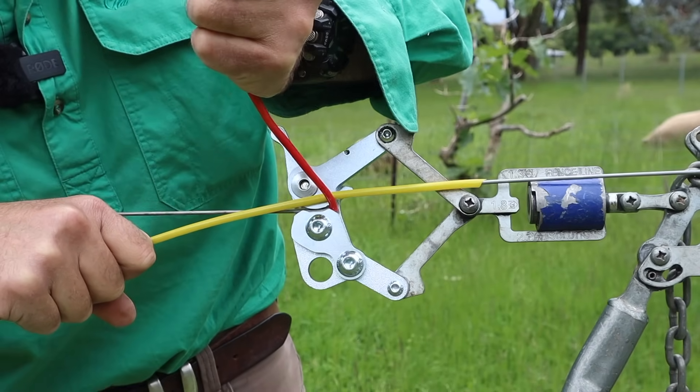Now let's go back to the red wire. Because the red wire has just gone underneath the yellow wire, the next wire it crosses, which will be the main line wire, it has to go over the top of, and it's now ready to twitch off. And in fact, we will do that now. Now the yellow wire is a little bit more tricky to twitch off. So all I'm going to do is just ease it underneath the line wire over the chain. Pull it up as tight as I can get it. It's a bit tricky with the plastic covering on the wire. And then when I take the strainers off, I can twitch that off properly.